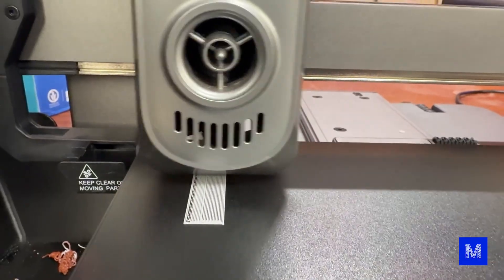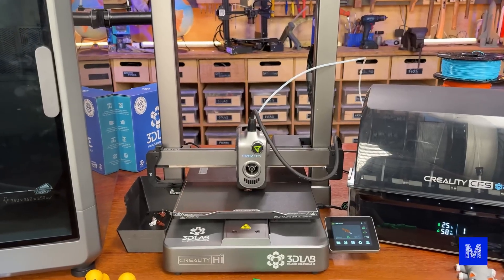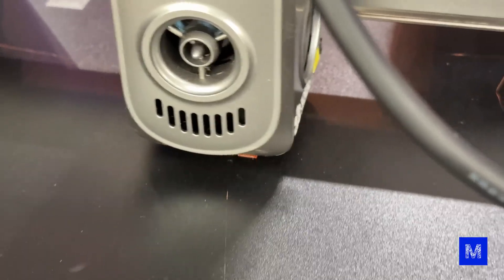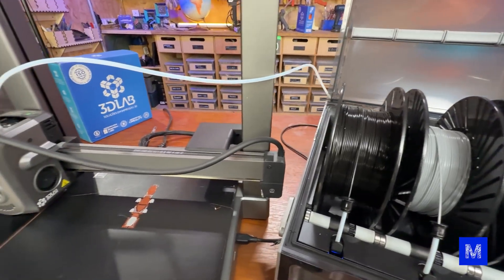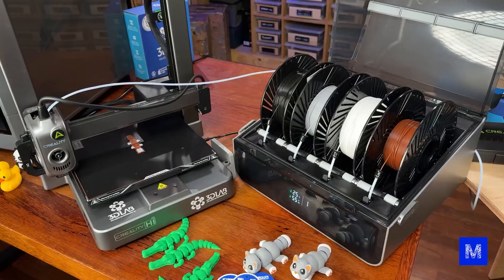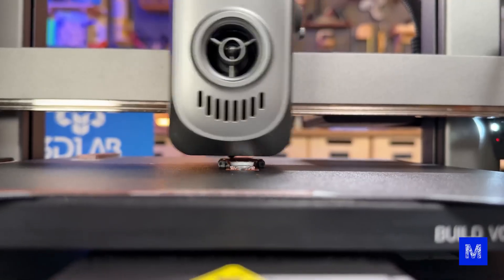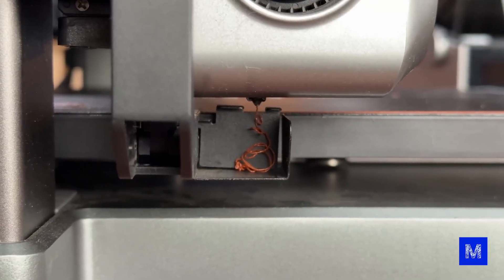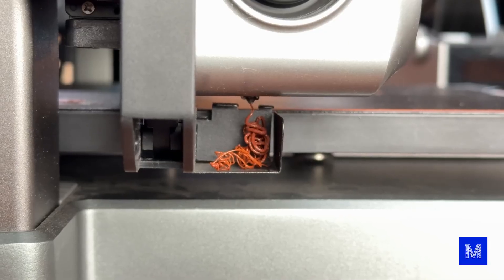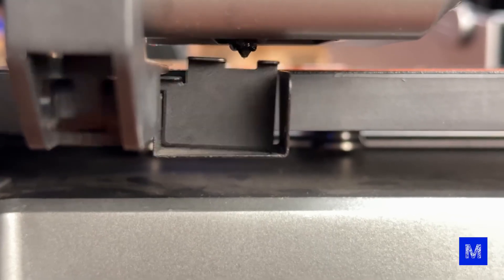What happens next? The printer will check which colors it needs. To start the platypus, down there it has gray paws and a brown body. The printer tells the Creality Filament System 'send the brown one,' loads the brown filament, and prints that part — it releases the brown plastic. Then the CFS collects that color, the printer says 'now send the gray one.' But here's a detail: at the printer tip where the plastic melted, it's still brown. The printer has to get rid of that, so it spits out a little brown blob.